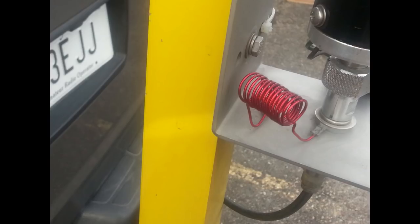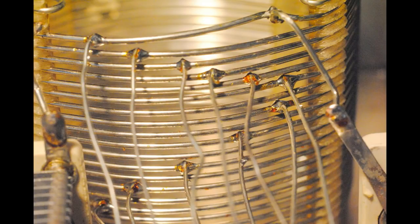And what occurs is that it'll then take your HF impedance on 75 and 40 meters and bring it up to 50 ohms, and on 10, 15, and 20, your setup probably won't even know that it's there.